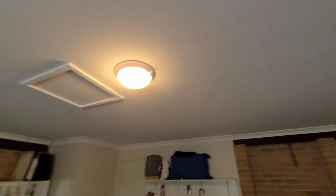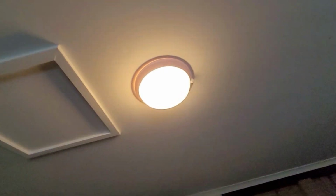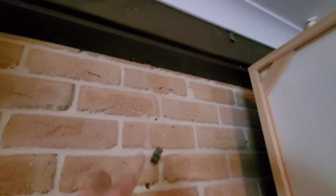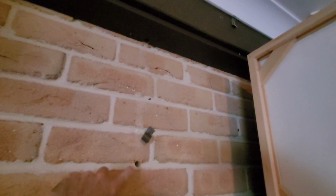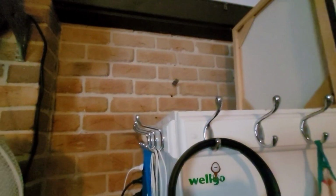And the first idea I had was around where this light is where the PEX runs, and I was going to tap into that with a 3-way T connector and then run it kind of adjacent to the manhole cover, and then come down, and there's a hole about there. So there used to be kind of like a PVC pipe, 20mm PVC pipe, which concealed some wiring, which then came out here. So I think there was a wall sconce on the other side at some point, since removed, well before we moved in.